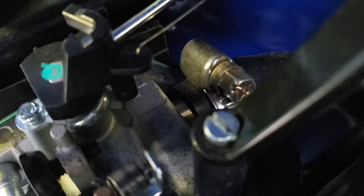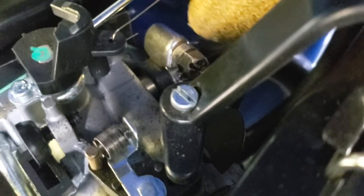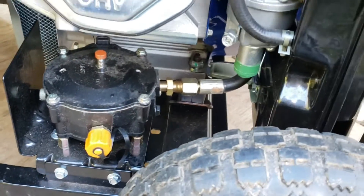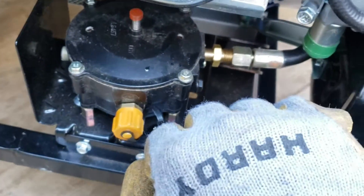...I'll take the regulator, disconnect this, and put the regulator for natural gas that connects to this. This tube already comes up and connects to the carburetor. In my understanding, the reason why natural gas does not work with this is because the regulator is set up for liquid propane. So just use what I already have — buy a kit, but only use the regulator, connect the regulator down here, take this off, and I'll see if that works. I'll try that in a couple weeks.